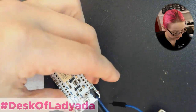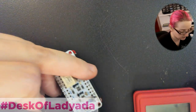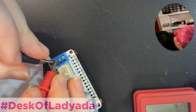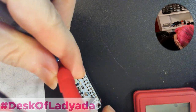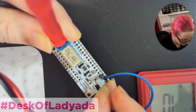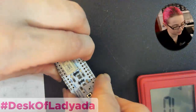There's a little green or red LED to tell you that the signal was actually received, and this one actually works. I grab my multimeter in continuity mode — set it and unset it — and the normally-open is open, then connected, then disconnected. So the latching relay works but the non-latching really doesn't, and I'm like, this is really annoying because there's not a lot going on in a relay — there's just a little coil magnet that moves an actuator.